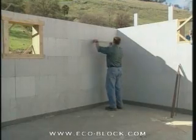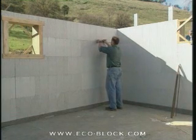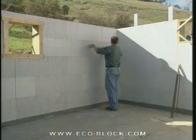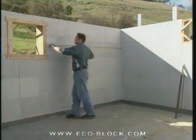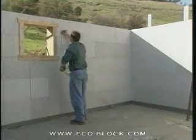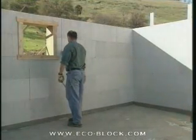The uprights are set approximately every 6 feet along the wall, starting about 3 feet from the corner. As you are considering where to place the uprights, think about where you'll want to be standing while pumping the concrete, as well as what surface is going to provide the wall alignment system with the surest footing.